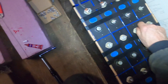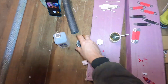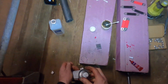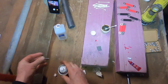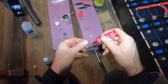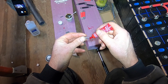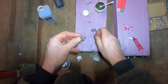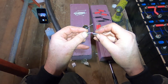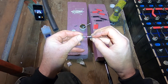Oh, I think I missed this one — crap. Okay, spray it and let it dry. A little bit of Threadlocker — and this is the permanent stuff, so once it dries that's it. Apparently you can heat it up to like 500 degrees if you want to remove it, but I don't think I'll be doing that to my batteries anytime soon. So these stainless studs are staying where they're locked.